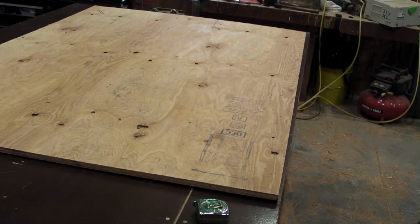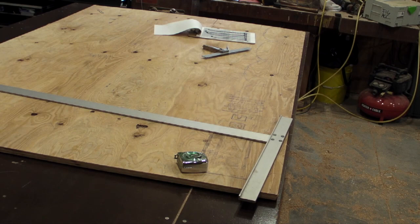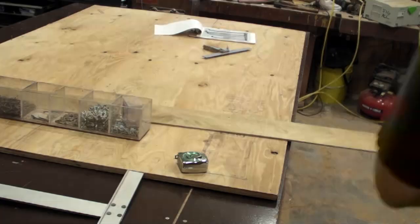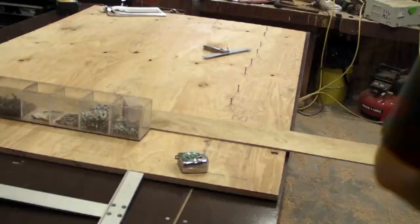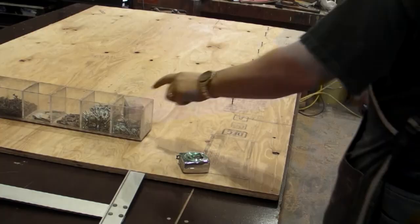Welcome back to the scenery farm. In this video I'm starting to lay out the bones — the plywood profiles — and this is the bottom I'm working on. What I'm realizing is I need something to help me do curves, so I put some screws on either side of the base of the bones and at the top, then I flex this quarter-inch plywood so it'll have the curve I want. This is the view when looking front on.